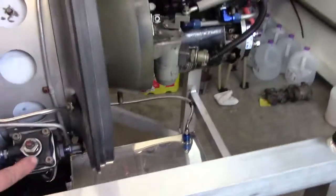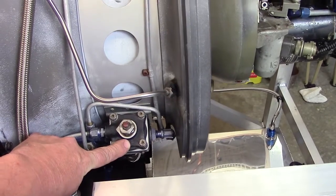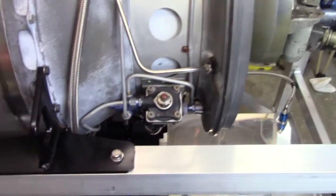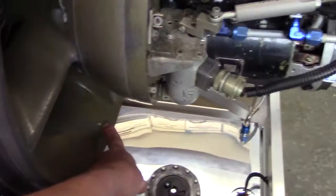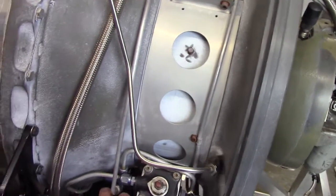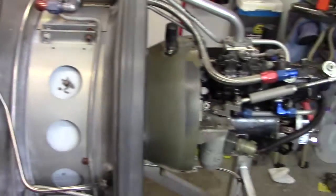The outlet from the fuel control then goes — not straight to the nozzles — but to this device here, which is called an acceleration limiter. It's a diaphragm-controlled fuel orifice that modulates the fuel and allows it to slowly increase, so as not to stall the compressor. It's monitoring compressor outlet pressure, and here there's a little port for inlet pressure, and a fuel pressure line right here off the inlet. It basically limits how fast fuel can be applied to the engine.